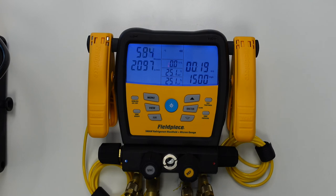And now we can carry out a high rise test on the system, ensuring our vacuum pressure does not rise above our high vacuum alarm limit. If the vacuum pressure does rise above the vacuum alarm limit, which in this instance we've set to 1500 microns, you will see the same alarm process occur. The screen will display a flash and an audible alarm will sound.